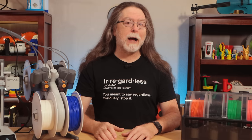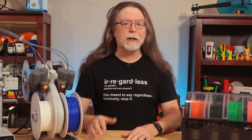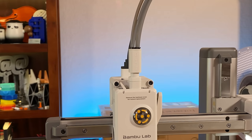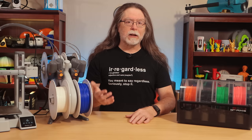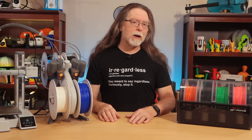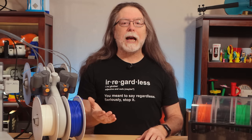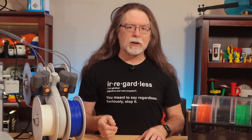When changing or unloading filaments, both the AMS and AMS Lite depend on being able to pull filament back from the toolhead. That gets it out of the way so the next filament can be loaded. In the case of the AMS Lite, filament gets pulled back just enough to clear the 4-in-1 feeder on the top of the toolhead. In the case of the larger, enclosed AMS, the filament gets pulled all the way back to the unit itself, because the 4-in-1 junction is inside the AMS. So if the filament snaps or breaks, there's no way to pull it back from the toolhead.